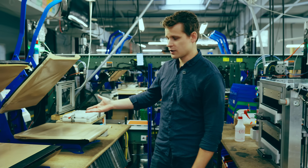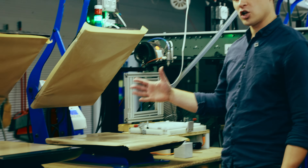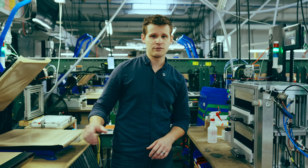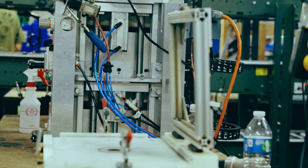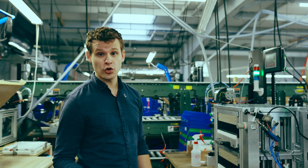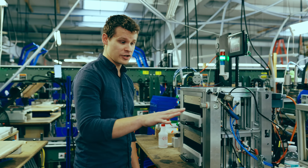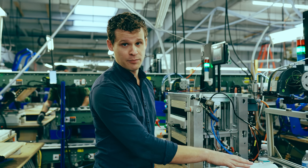We've been using these heat presses here for a long time, and they've been good for the job, but there are still some barriers — some wide tolerances we've had to deal with with the product and with the heat these give off. Part of our job in engineering is to improve on that tool and make it more consistent and deliver a better product. And that is this machine right here, which is a prototype of the new heat press that is completely T-Rex designed, built, and will be assembled when we get to the final version of it. This tool brings a lot of improved features, but the main one is that the Kydex is heated consistently throughout the sheet material. There can be no stresses, no areas of low definition that land on the finished product. Consistency is extremely important for this process.